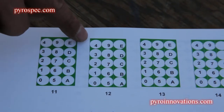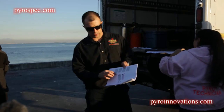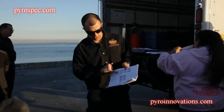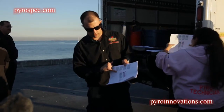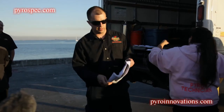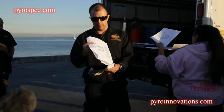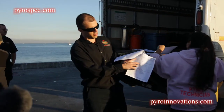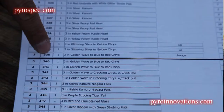The numbers inside of the individual guns here are the actual Q number for that particular module. So for example, this one right here would be module 11Q7 on module 11. So on the address on the Q sheet, it would have an address of 117. The first two numbers on the Q sheet are the module number, and the third number is the Q number on that particular module.